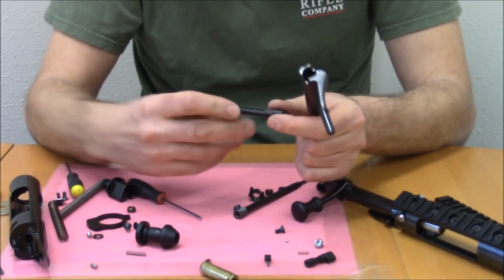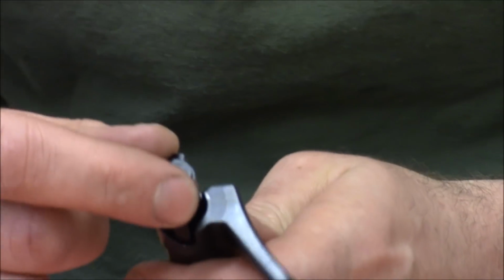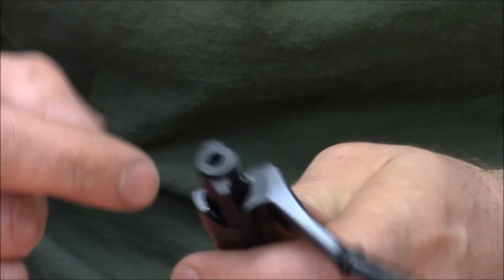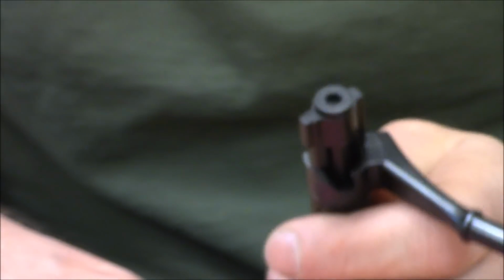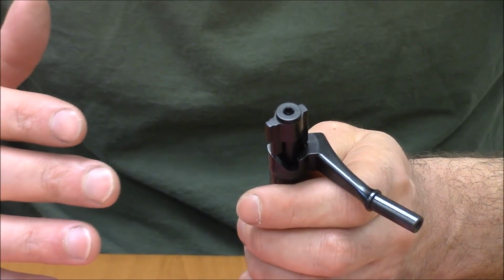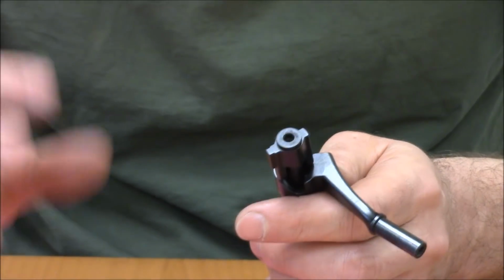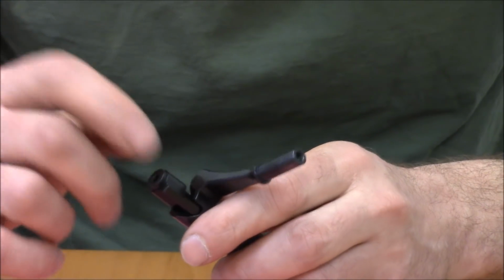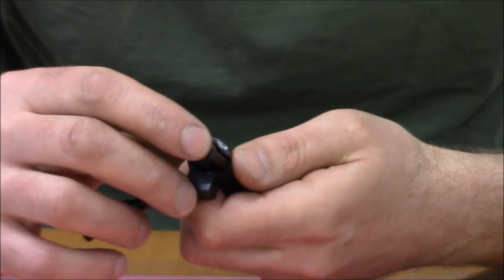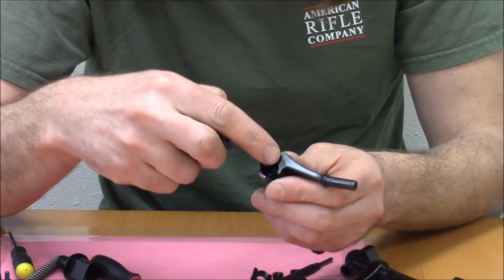Cocking cams. There are dual cocking cams. We did that in order to minimize the forces required to cock the action. Basically, this eliminates some bending moments associated with the cocking action that would otherwise lead to contact forces between parts. Those forces would otherwise contribute to friction. That gets pretty deep, but I'm just not going to go too far into it right now. Suffice it to say, we did dual cocking cams in order to keep the bolt lift a little easier.